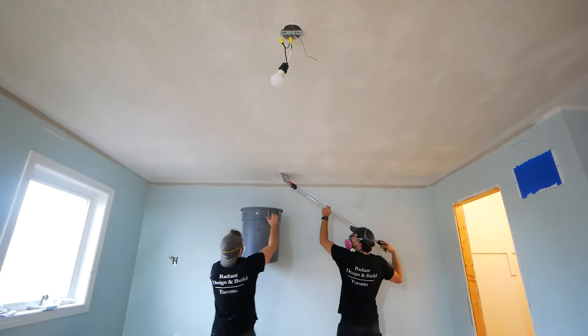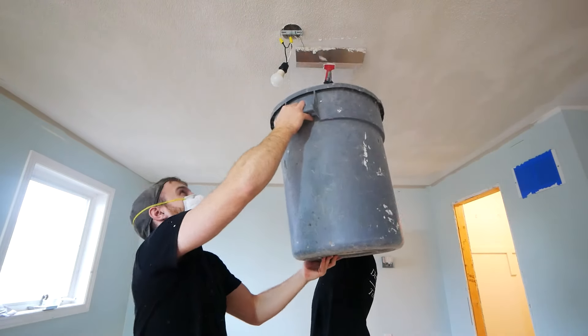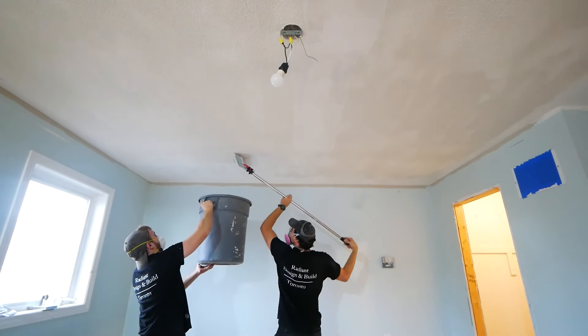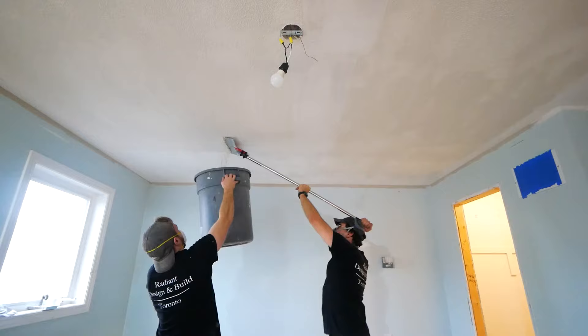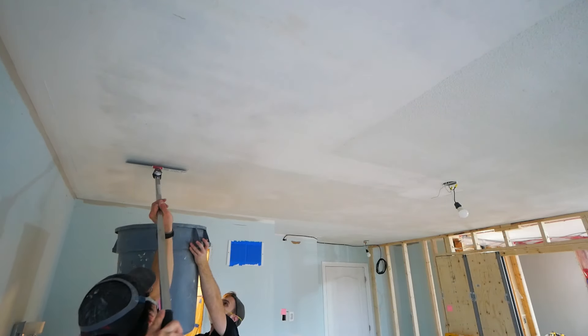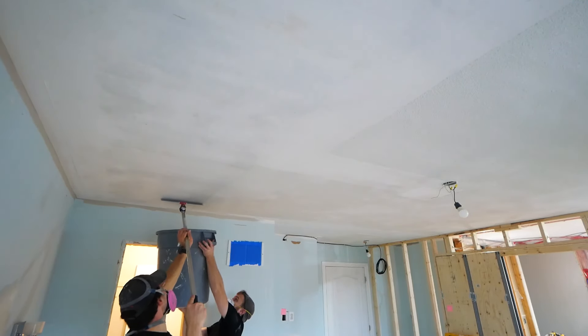This is roughly 10 minutes after we had begun to spray the ceiling — that has given the popcorn enough time to fully absorb the water and begin to weaken, and now we can easily scrape it off. I would strongly recommend having two people for this process: one to scrape and one to hold a bin beneath to catch any of the debris, which will really reduce how much cleanup you'll have.